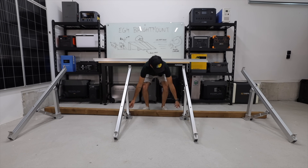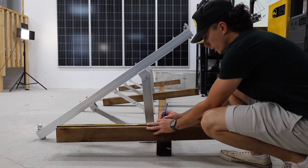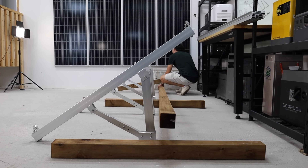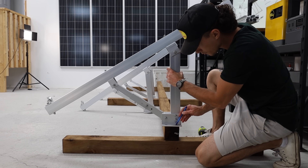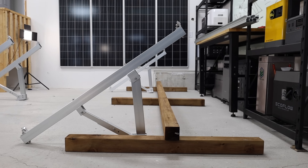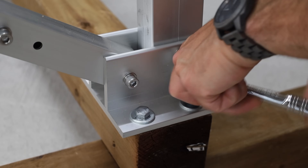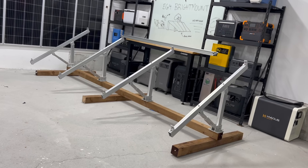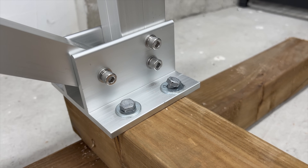We don't have somewhere to permanently mount this, so we built a quick little base. I picked up a 12 foot four by four, which is actually a foot narrower than the overall dimensions recommend — but with the sliders it doesn't really matter. I put three feet across the bottom, offset them a couple inches toward the front to help with the weight distribution. I traced out the holes onto the top four by four so my screws didn't get in the way of the lag bolts. And yes, when you see this thing rocking on the garage floor, that's actually the poor quality of our garage floor, not a warped piece of wood. I screwed the feet on, fired some lag bolts into the four by fours, then measured the gap between the two feet — and we're almost done already.